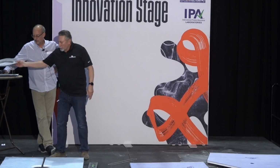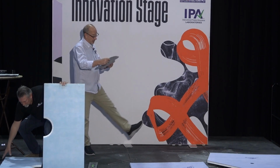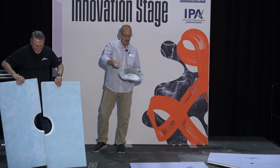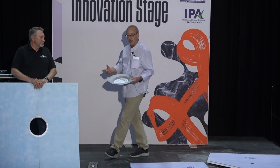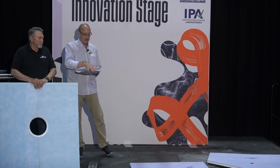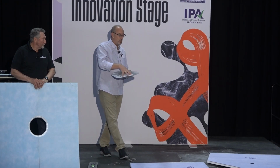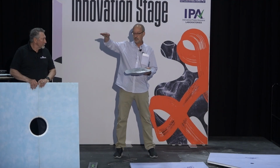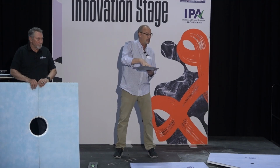And do the mud. This is available in about 8 or 9 different sizes, ranging from 3/4 of an inch up to 1.5 inch deep. So it depends how the divot is. A lot of the commercial drains out there, like a Zurn or something like that, a cast iron drain, when you put the membrane into the clamping ring, into the threaded strainer part, that'll bottom out usually at about 3/4 of an inch. So I need to transition from a 3/4 inch mortar bed, drop down into that clamping ring, because the drain doesn't go low enough.